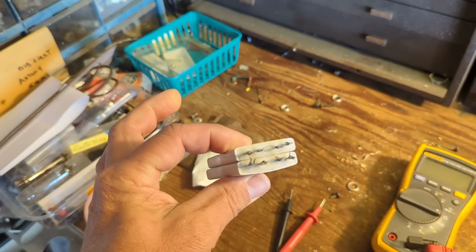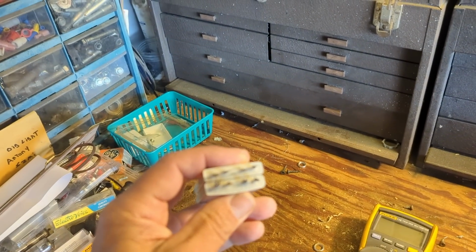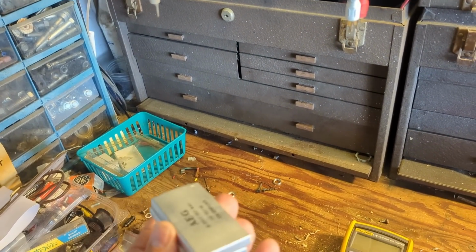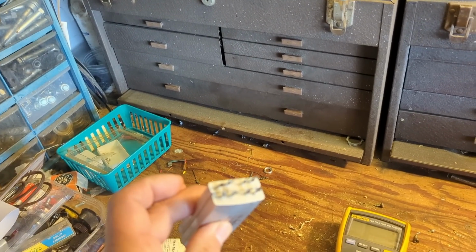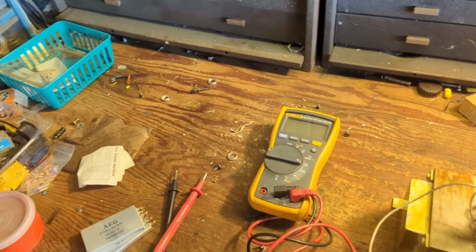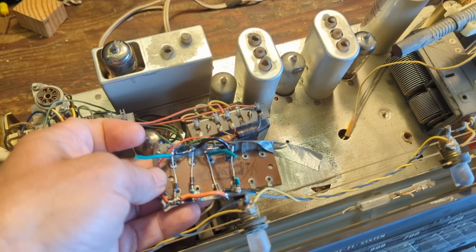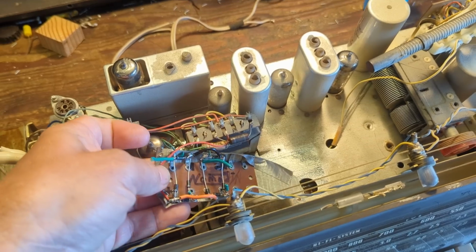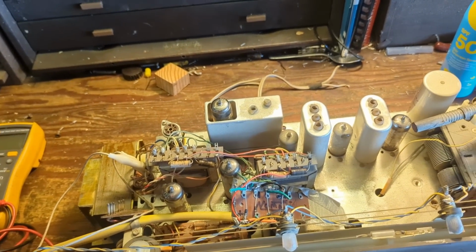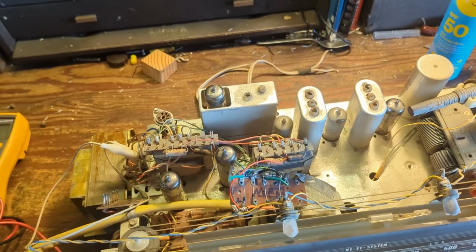So what I realized after talking to my friend on the phone was it's not like this is 2 rectifiers stuck together like I thought. For some reason when I first saw this, I thought this set has 2 rectifier bridges in it. In reality, no, it does not. There's 2 rectifiers inside of each one of these. So you put them together, that makes a rectifier bridge. So stupidly, what I did yesterday was I made dual rectifier bridges and connected them together. And that was okay, sort of for B+, but definitely not okay for these guys off the output transformers.